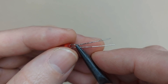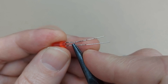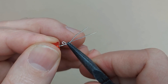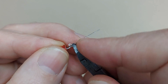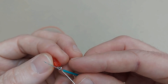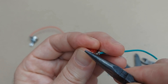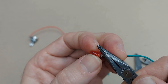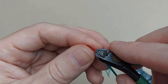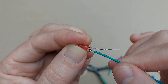I want this component to be more like the knob with the loop in the end, so I'm actually going to bend this leg and create that loop myself. I've used my pliers to create a little loop in the end of the leg, then use my cutting pliers to trim it. Now I can pass the wire through this little loop and do a similar kind of wrap to what I did with the knob — with each wrap pulling the wire as tight as I can against the terminal. Once I've gone around twice very tightly, I can trim the excess wire and have a good, strong connection that's also reasonably clean.